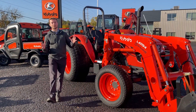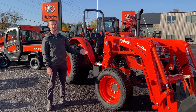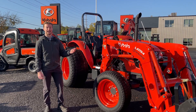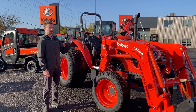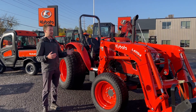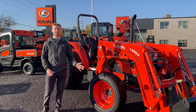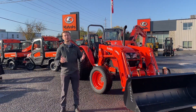Lastly, tire choices on the M7060. This unit has a turf tire setup — probably the last time we'll see this for a while — and you can see just how wide those rear tires are for floating on golf course fairways. For most people you'll want an ag tire, preferably a radial ag tire as they last longer than bias ply. The ideal setup is R1 ag tires with a cast center disc in the rear for added weight, since traction and a heavy rear end are key when pulling implements. For snow use you can also get Nokian snow tires, just like on the L6060 and larger M series tractors.